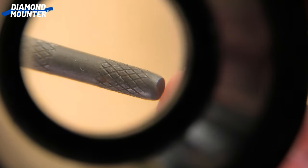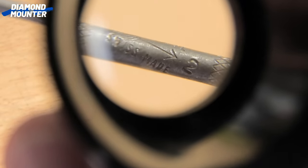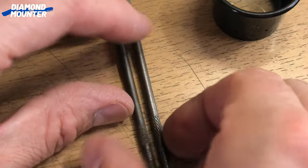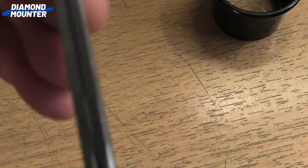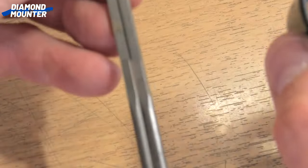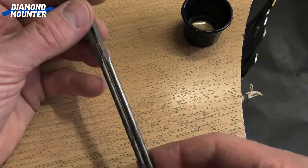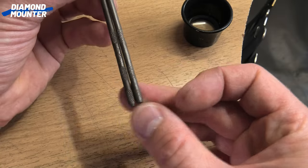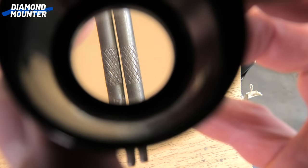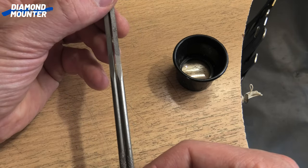This other one is the F.Dick. Have a look at the end — the milling is a little bit different. F.Dick brand, arrow cut 2, which refers to the coarseness of the teeth, Swiss made. But look at them side by side — the teeth are different, but the way they're chamfered off, I reckon these file manufacturers just buy the same blank from the same place and then do a bit of cutting themselves. They're so similar it's like they both own the same machine with different settings.